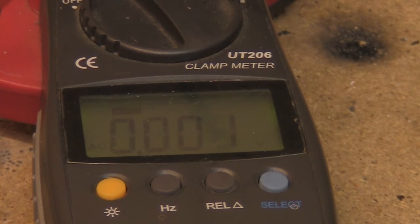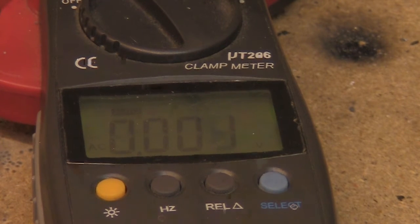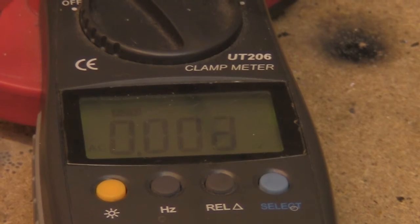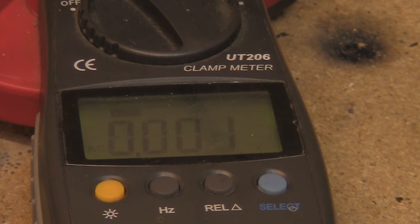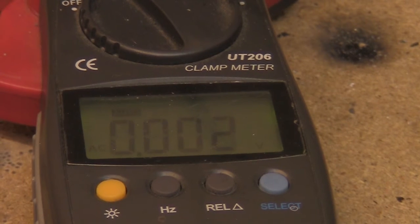Now what I have just done is switched off the transformer. The parts that are still arcing - therefore you have got quite a bit of potential left in that capacitor - you can watch what happens on that meter. It is too quick for me to actually see what is being registered, so I am quite sure that you guys will get it. So I do recommend that you switch off the transformer, then discharge the capacitor, then unplug it.